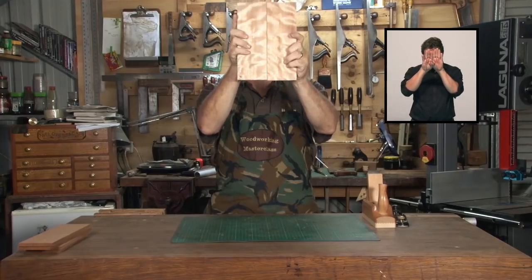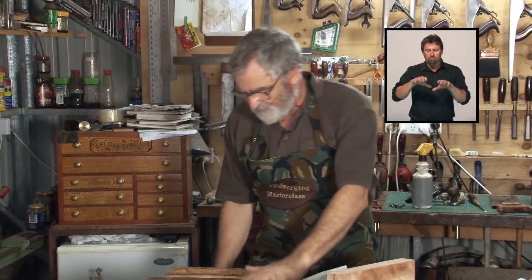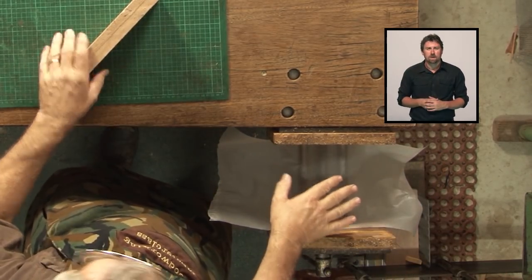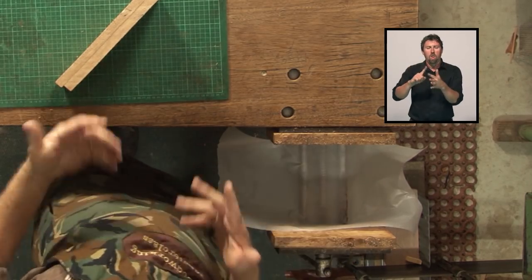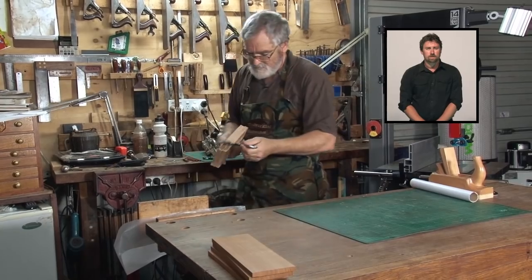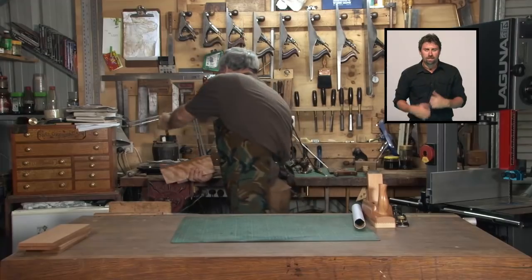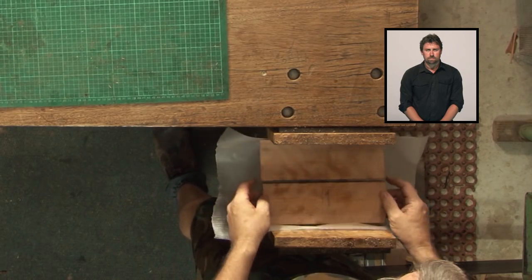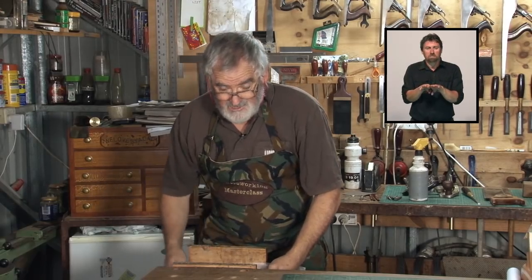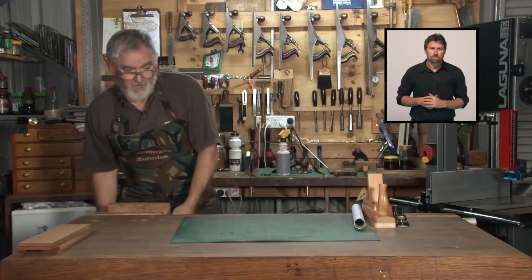I'll put the pieces together — no light showing, so I'll glue them up. I use waxed lunch wrap with the wax surface facing up. I put it in the vise so if glue drops onto the screw thread, the paper is in between and it doesn't clog it up. A bit of glue either side. I haven't bothered dressing the timber before gluing it together — at this stage it's not necessary and it would just be a waste of time.